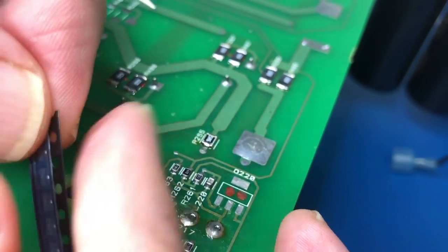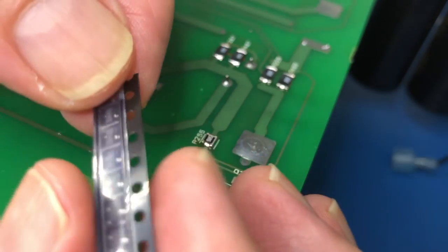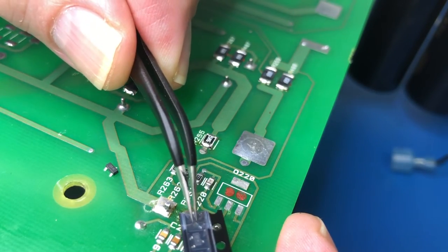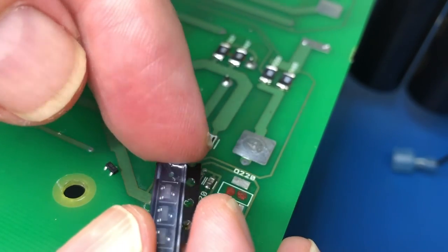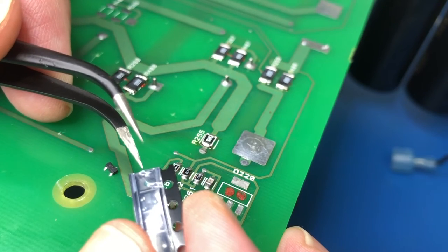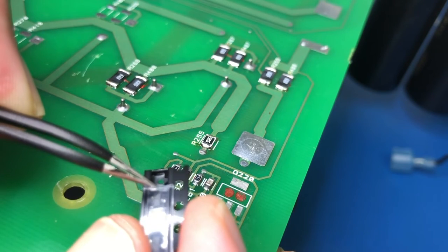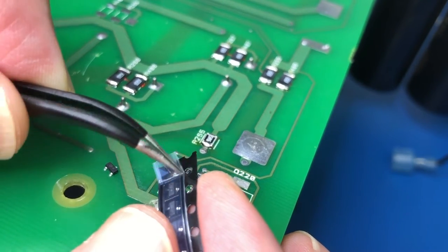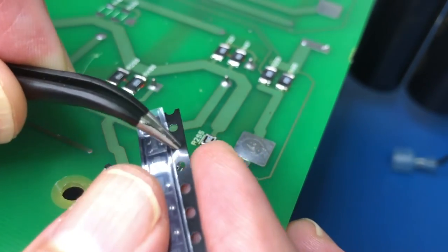that covers up the component and holds it in there, but you have to have it folded back a certain distance. Oops, there it goes. And then a nozzle will come in the pick and place machine and it will come down and pick up the component. But usually, just the way the geometry of the feeder works, this tape will be peeled back. For a relatively large component like this, it might be peeled back, say, one or two more components. So each one of these holes corresponds to like a tooth in a wheel that feeds this along.